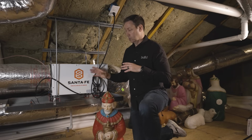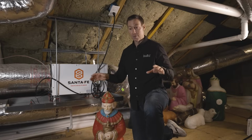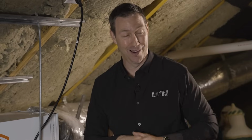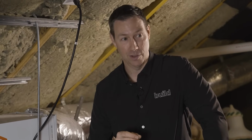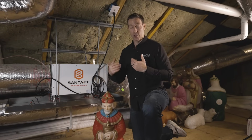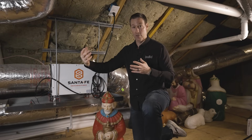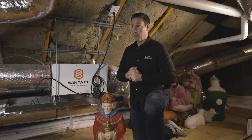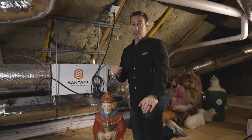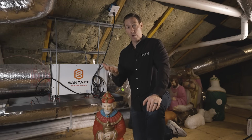When this system was originally designed, Positive Energy told me to put a 70H downstairs and a 70H upstairs. But I've got a big house, I've got a busy house, I've got teens that shower way too long, and don't forget, I've got 24/7 fresh air out of my Zehnder system. And that Zehnder is definitely moving moisture from the air streams. It's a balanced system, meaning it's putting 100 CFM into the house and exhausting 100 CFM, but it's very humid outside in Austin, Texas, a lot of the year. And as a result, that fresh air could actually raise the humidity in my house.